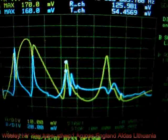This one is 68 megahertz. You got to remember, when you introduce the capacitor to the center lead and the one of the right-hand side winding of the pickup coil, you're lowering the resonance frequency. Now you're regulating and adjusting.